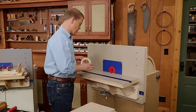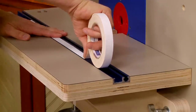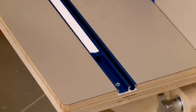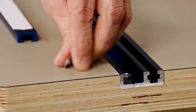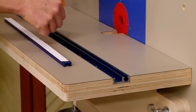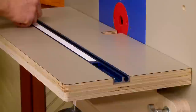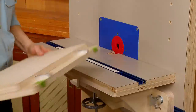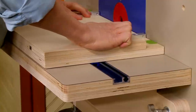I'm ready to put on the double-sided tape, running it down the entire length of the track. Before peeling off the backing, I note the runner is still pretty flush with the tabletop, so when I press the mortising jig in place it may not stick well enough. To raise it up a little, I use a set of three small washers set into the miter track. Then when I set the runner in place, it's raised up and will make good contact. I peel off the backing, take the jig, set it in place, and align the end of the runner with the end of the jig before pressing it down.